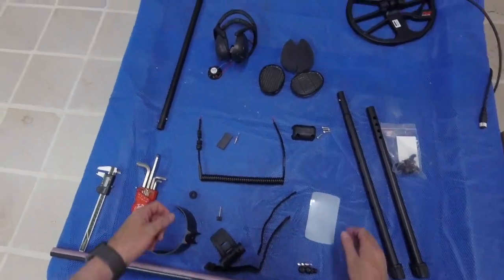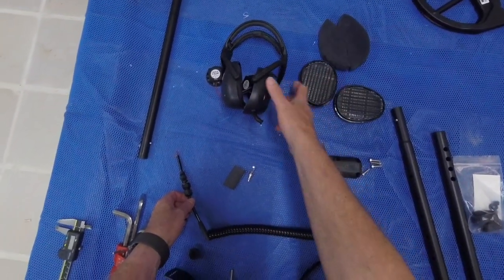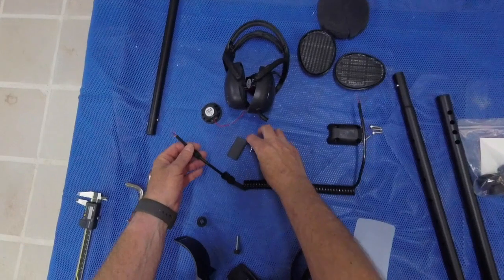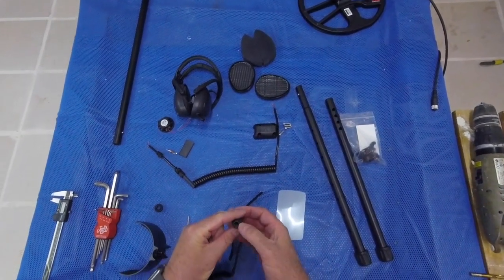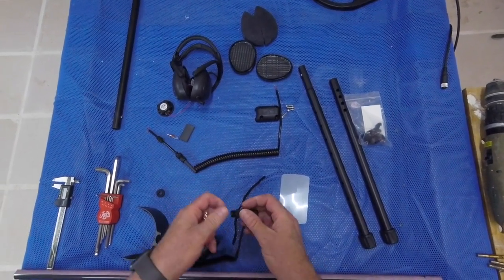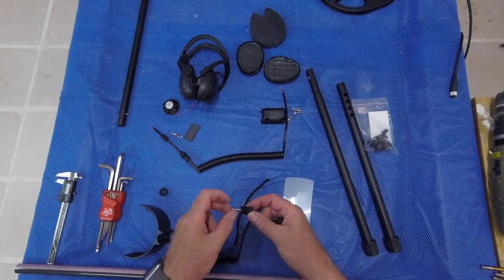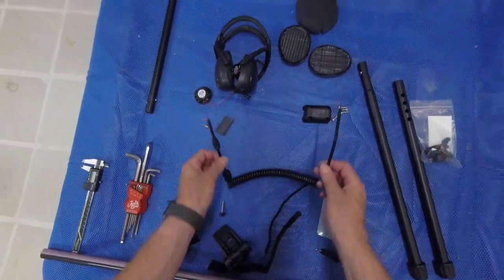And the next thing is I'm going to look at sorting out some headphones. I already had a spare set of surf phones from Mal, and I'm going to modify that. I bought a curly cable, I've got the connectors, and I've got the 3.5. Just to show you what I've done with this one, this is the standard M12, and it had the 8 pins in it. I extracted the pins from the unit, and this now slides in there perfectly. And what I will do is put a little bit of resin at the bottom edge to stop it moving around.